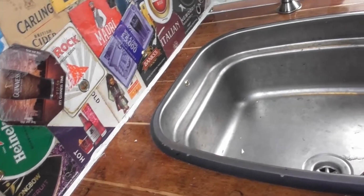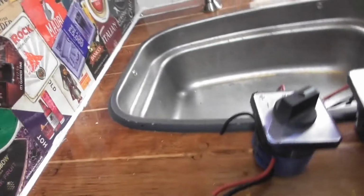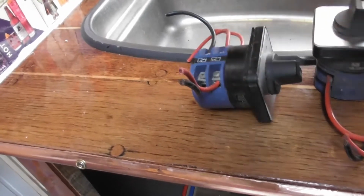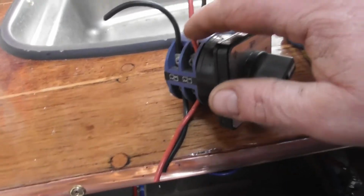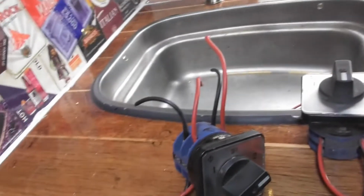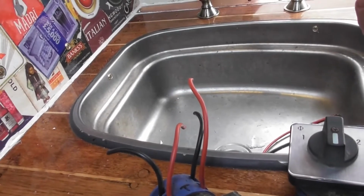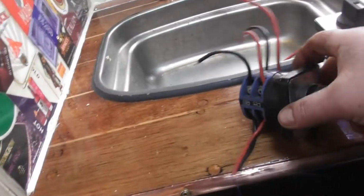You got one set of wires going in. It's a dual pole. What that means, if I've used the correct term, is when you flick the switch, there are 2 switches that automatically are joined to the shaft in here, and they both at the very same time click over. So you've got your live and your negative that goes in, and then it will come out exactly. So in a 240 situation, instead of just turning one off, you're effectively turning both of them off and switching them over at the same time.